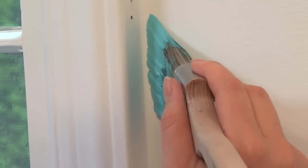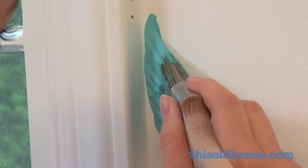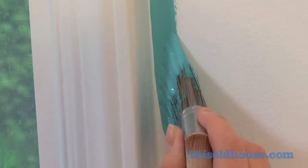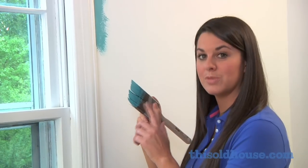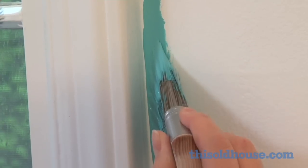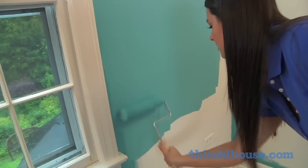Press the tips of the bristles against the wall just enough to arch them, but not enough to paint with the sides of the bristles. As the brush draws along the line, the slight pressure delivers the paint stored between the bristles to the tip of the brush and onto the wall. After each stroke, tip off the line with a light stroke using only the bristle points. Feather out the edges and roll the wall while the edge is still wet.